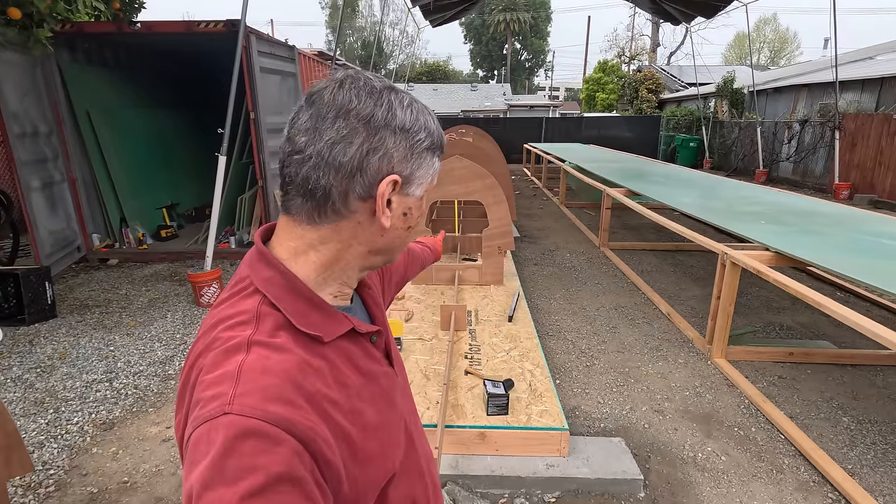You can see how easily this stuff bends to get onto the hull shape — it's really pretty easy. Initially we're going to have three-inch strips, and as we get further up they'll get narrower and narrower because we have to make these tighter curves up at the top. In places with tight curves we have to go to narrower strips. This is just a dry fitting and we'll do the whole thing dry first, then go back and epoxy one at a time — but that won't be today. What we're doing right now is putting packing tape along the edges of these plates because the epoxy we're putting on later won't stick to packing tape, so we have to coat these in packing tape first.